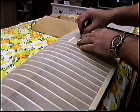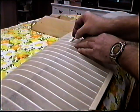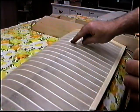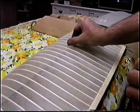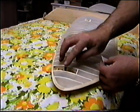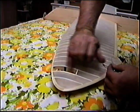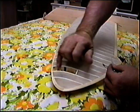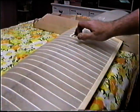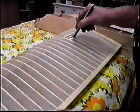Now, several times what I've seen in making I-beam wings is the problem occurs that, let's say for instance, you didn't have this real solid, this would tend to wrinkle right here. So far that has not happened. Now, what I did out here on the tip, I was assuming if it didn't wrinkle now, it's going to be fine. This edge right here is fine, and I'll radius that all off with a sanding block. Anyway, there's an edge. I'll radius the edges right off. Always get the edge radiused.